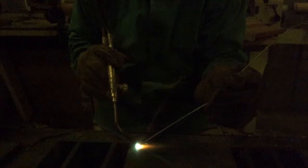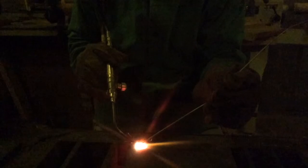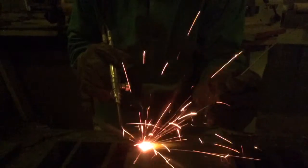Now, I have my piece of metal here to get in the position that I was talking about earlier. I've got my filler rod in the other hand. I'm going to start making a circle with my filler rod, nice and down there close. Once I get a puddle, I can get my filler rod right close there, and when it gets a little molten ball of metal on the end, I can dip that right in there.